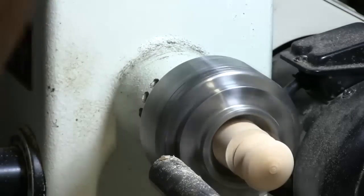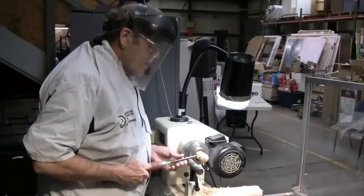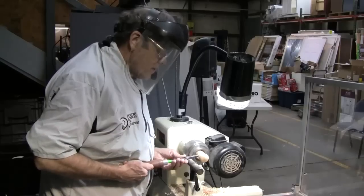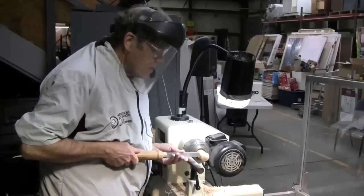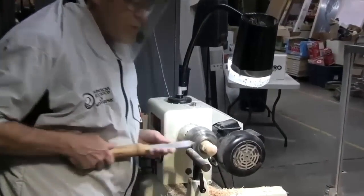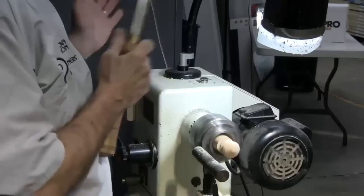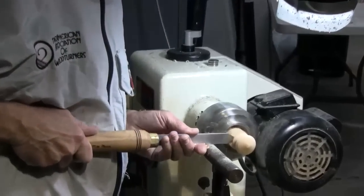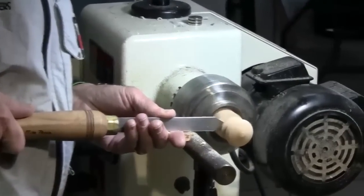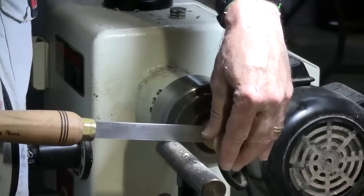Now keep in mind, this is going to be a little bit larger, just a hair. So you need some kind of way to test it. If you're doing it this way, you want to have done this before, to make sure it fits your particular drill bit size hole. And then probably you'll find you still have to come back just a little bit to make it a little bit smaller. That's why, on the one I passed around, sometimes it's easier to do it with the knob side out, and you take your lid and try to fit it to make sure you've got a pretty good fit so the glue will hold. It's got a nice mechanical hold. And when you get it all done, just part it off. You don't want this too long, because the hole you drilled inside the lid doesn't need to be much more than about a half inch or so.